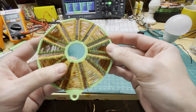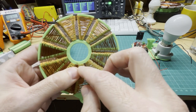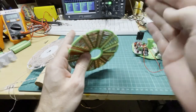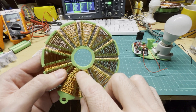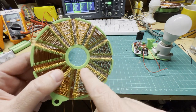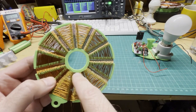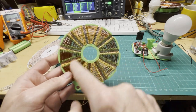It's bifilar, so the two wires go through here — one wire goes to the left side and the other goes the opposite side. They weave like a DNA strand. At every node point they cross, going on opposite sides of each spoke. Both wires go counterclockwise but weaved opposite ways on the spokes, so they always cross. There are 11 spokes.